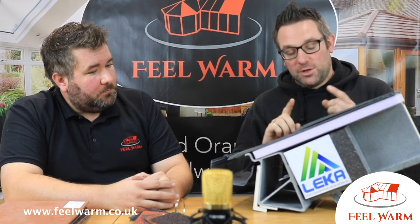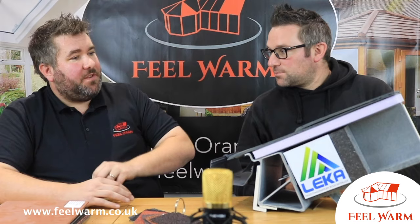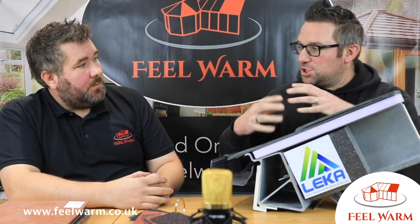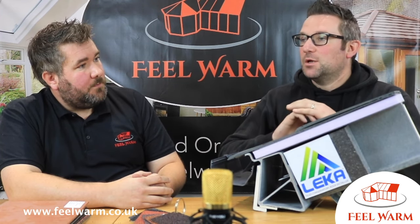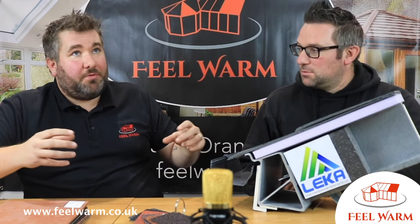But don't forget that was done for holding polycarbonate and glass sheets. I presume they accounted for things like snow load, but only with those polycarb sheets and glass, right? Absolutely. So it's based on the conditions it believes it's going to be in. Like you say, snow load, maybe a foot of snow, it calculates it to take that kind of weight, but no more than that. Because they're not going to make their system so expensive that it could hold three or four times the weight it needs to. They're going to make it so that it only just is enough to get the best possible price for the customer, right?